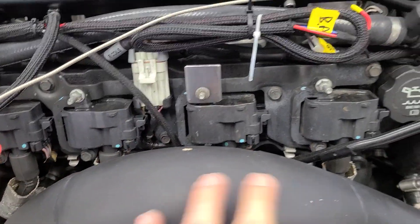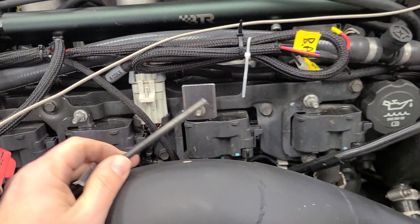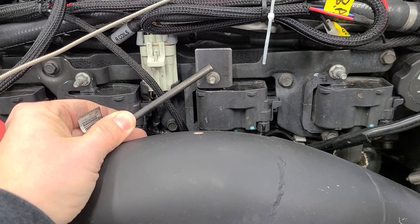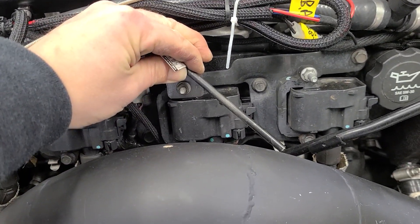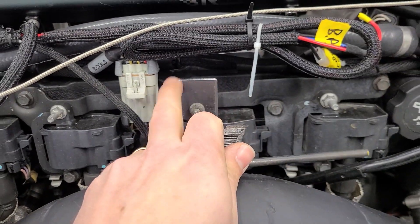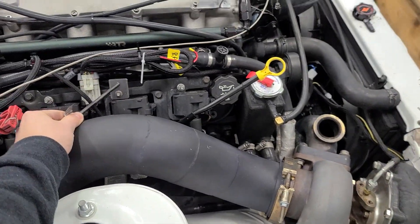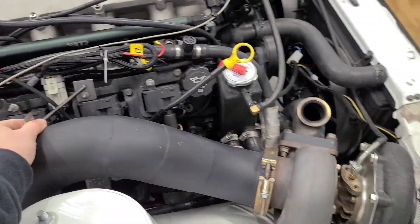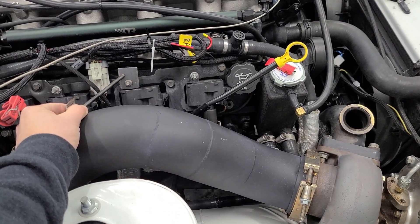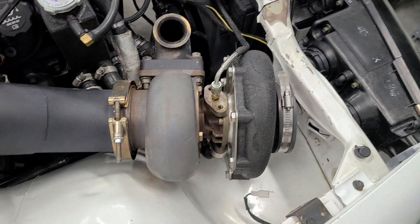Weld one up there coming out at this angle and then weld one on this side coming out at this angle, then weld them straight to the downpipe. I want to make it at least visible, so I don't want welds up here on the top - I want the welds to be down here if at all possible. Probably run these round rods something like this, and then that'll just be my downpipe bracket. I'll possibly just trim off any excess that's up here that doesn't need to be there after I'm done. I think that's going to be the best solution and still look pretty cool if it comes out right.